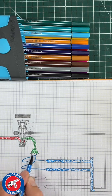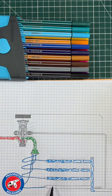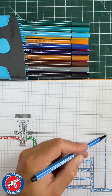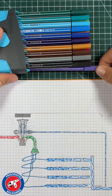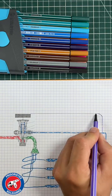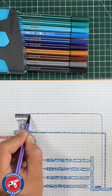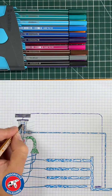The evaporator outlet port is connected to the external equalizer of the expansion valve to read the evaporating pressure, and the bulb measures the temperature of the refrigerant. The forces acting on the diaphragm of the valve are opposite: the bulb pressure at the top opens the valve, whilst the evaporating pressure and the spring pressure below the diaphragm close it.